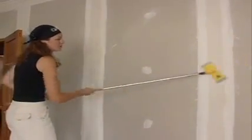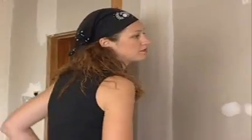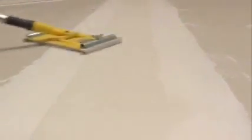Both of our rooms have been prepared in advance, but if you need to find out more about the important steps in wall preparation, you'll find more information in the last section of this video. Just a reminder about the importance of applying a good coat, maybe even two, of size to the wall surfaces. Size not only seals the wall surfaces, but it reacts with the pasted wallpaper, creating a slight slipperiness, which makes it easier to slide the wallpaper into position.